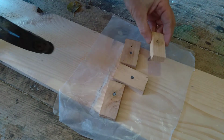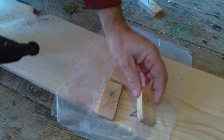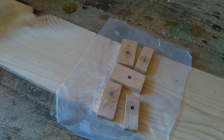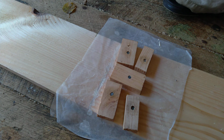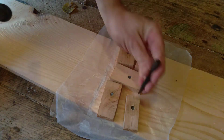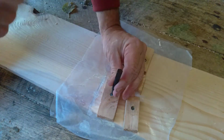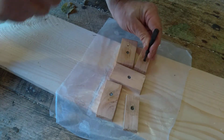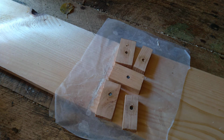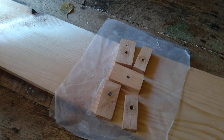Watch your fingers. Alright. There, that's looking pretty good. And I'll get this one of the nails sticking up off the floor so we don't step on it. And yeah, I'll go ahead and just grab one of these nail sets I got up here just to make sure we sort of double tension everything. Alright, and now we wait. Yeah, anyway, that's the sort of process of a quick scarf joint for an Alpha Dory shear strake.